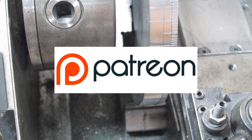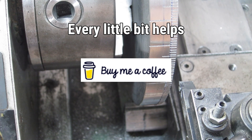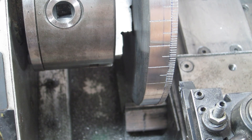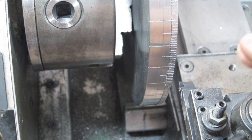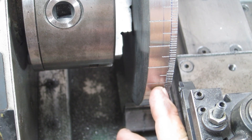I'd like to take this opportunity to thank my patrons — their support is greatly appreciated. If you'd like to become a patron, there's a link in the description; it costs a couple of dollars a month and helps me keep this thing alive. If you've been enjoying this, give it a big thumbs up. Now I'm going to flip this tool back over — the little 0.2 radius tip — and come in here to put a little groove in there to tidy up the ends of those lines, and then I want to put a 3mm groove up in the center here for clamping purposes.